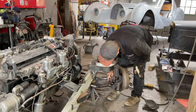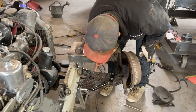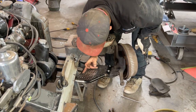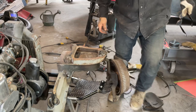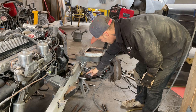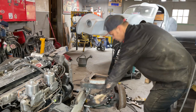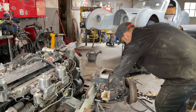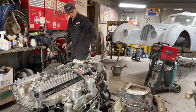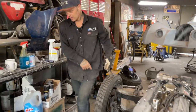As I'm looking at it here, this control arm's got a bend in it right here. I'm just wondering if I should cut it over here and get that bend out of it and lay it down more flat. There's a bend here and it's affecting this part a little bit. I'd like to see it lay flatter. I think maybe we'll chop it up there like that. But that'll have to be welded all the way around, and that'll make sure that arm stays together really nice. That's good. So basically what I've got to do is take this one out, make a piece for this side. I have a pattern over here, what I've cut it out with.